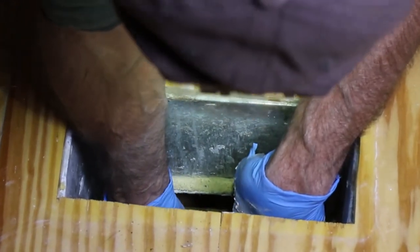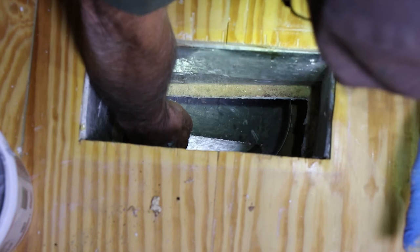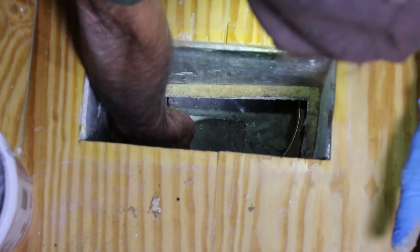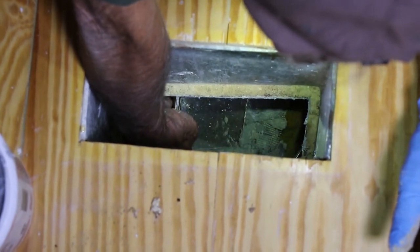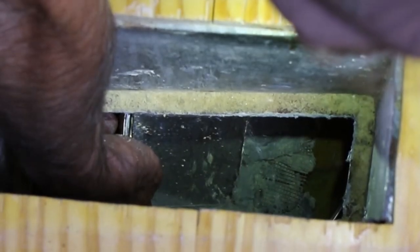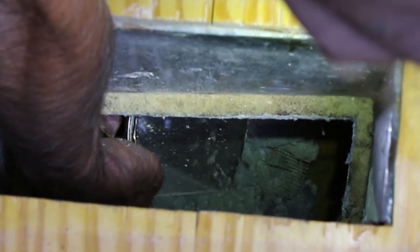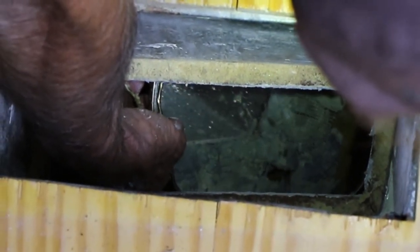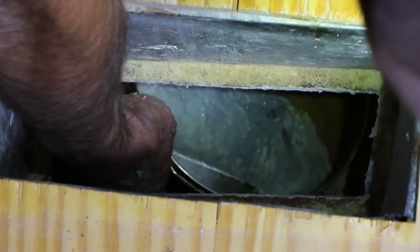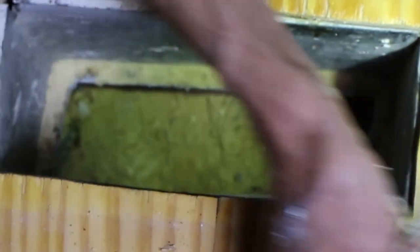As you can see, it's a little difficult to work. You're on your hands and knees bending over, not really able to see that — that's what the mirror comes in handy for. Now I take that mirror and inspect my work. You can see in that area there, all I see is mastic, so it's a good job there. Now I move over to the other side and what do I see? I can see the mesh tape, I can see some duct mastic there — not really done perfectly, so I will go and finish that off. I'll do a quality control check of my work in real time and then finish up. Take that mirror out.